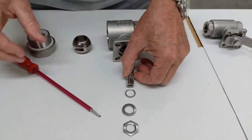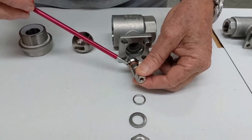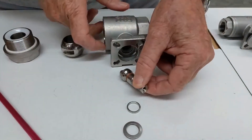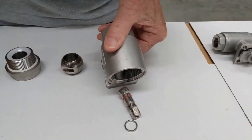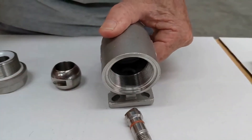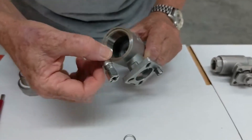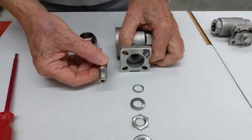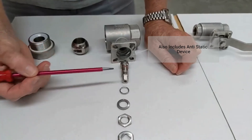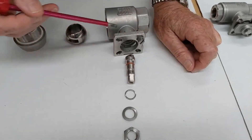The spindle itself is fed from inside, so it's a blowout-proof stem, and it has a conical-shaped seat on it just here. That seat will seal against the conical-shaped thrust washer which is sitting in the top of this unit. The stem sits up against it, and the harder it pushes up, the more it beds into that conical-shaped face — in itself a sealing member. There's also an O-ring here which is Viton FKM, which is an extra backing between the bottom thrust washer/seating member and the top chevron seats.